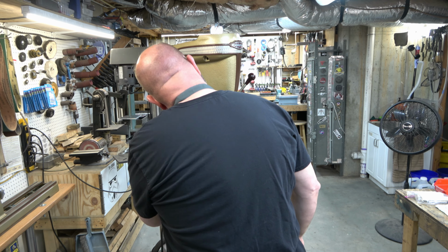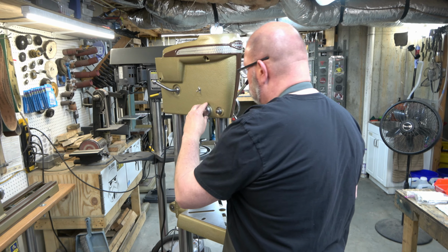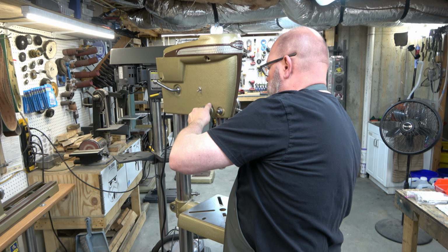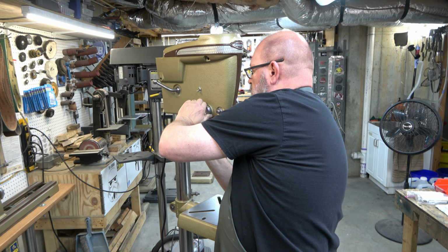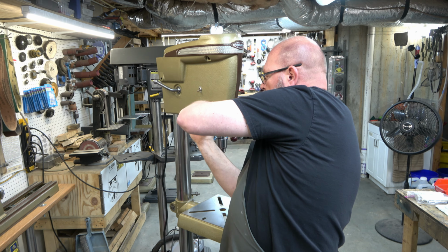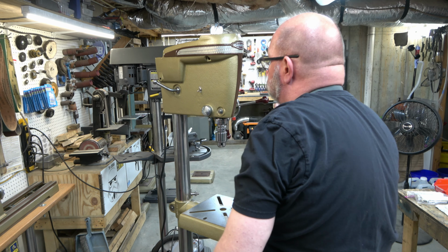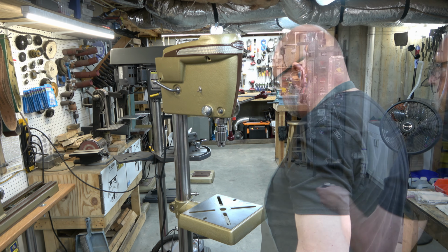Next, we're going to go ahead and install the feed tension knob and then tension the feed return spring. So once we've got it in there, there's 2 prongs on it that engage the dog leg on the feed return spring. And as we turn it away from us, counterclockwise, it will cause the quill to rise. And then we can tighten it down once we've got it where we want it and check for that return. And that's about how we want it, kind of a snappy return.